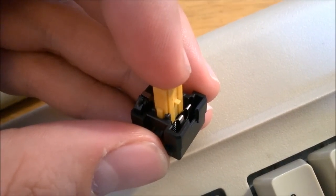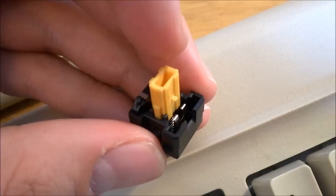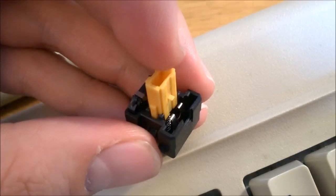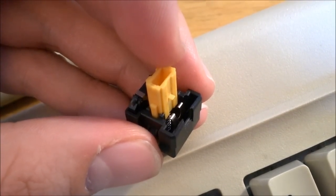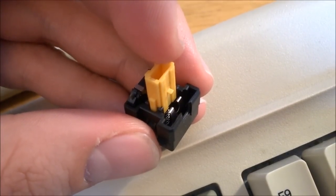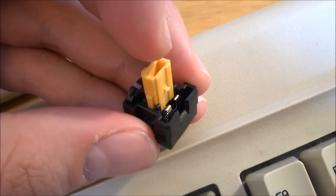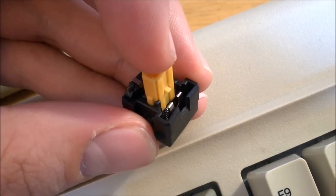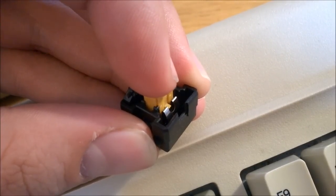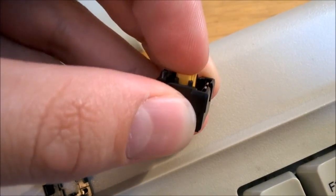Now, the way I think it works here is that because the front of the click mechanism is much more flexible, it is allowed to be pulled forward much more than that with an Alps plate. So the click happens further down the key travel too, but it still has the high actuation point of Alps switches. So there is a Grand Canyon-sized gap between actuation and click. Let me show that here to you. Just look how far I can push this slider before it clicks. There you go. Now the slider is almost all the way down already.